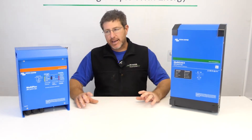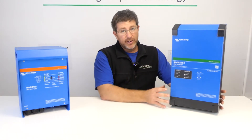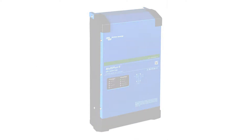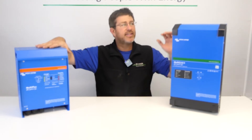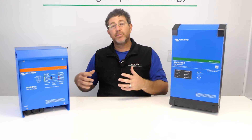We'll use these two Victron products as an example. This is Victron's hybrid inverter, so this is more designed to work with the grid. If you're around the world and you've got the grid available, this is probably more likely to be compliant in your area — but check your local specifications. This other one here is more of an off-grid inverter. One of the big things I look at is the weight — this one is a lot heavier than the other, so it's more designed to stand by itself and not lean on the grid.